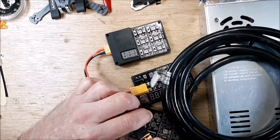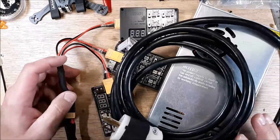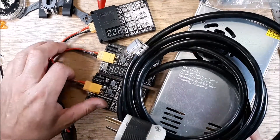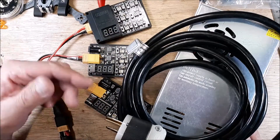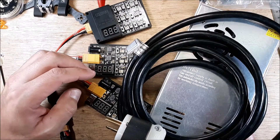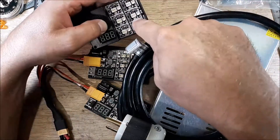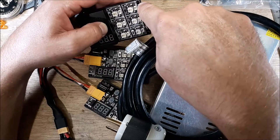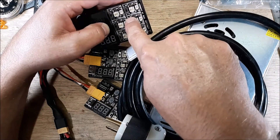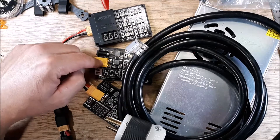I just plug this in and we're ready to go. This is one way you can do it with a power supply big enough to handle a whole bunch of these. What I like to do — because I'll keep rotating my whoops when flying indoors — is run three different packs. I'll charge them different ways: 0.6 amps and 0.2 amps, at 4.35 volts and 4.20 volts. On another board I'll have a different setup — like 450 packs for my bigger whoop.